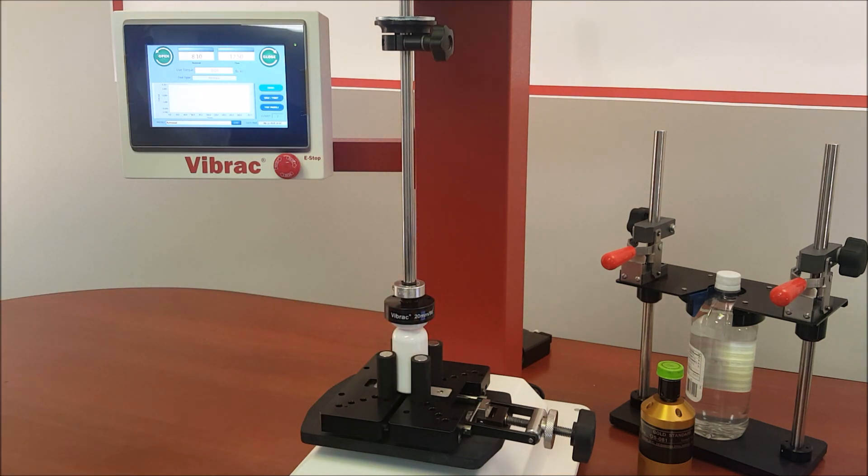Press the Open button and the Cap Inspector will apply opening torque to the cap until it begins to move. Then it will stop and reapply the cap to the preset torque entered when creating the profile. Since the movement of the cap is at the breakaway point, the seal is not compromised, making it a non-destructive test. The data gathered will be displayed on the touch panel screen after the test. You can either save or clear the test results.